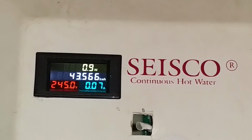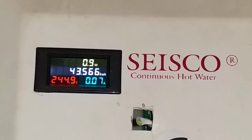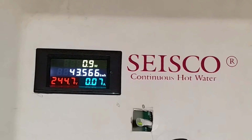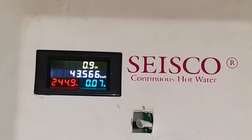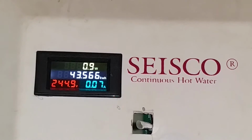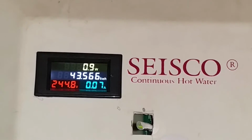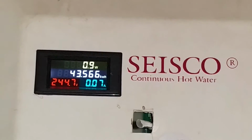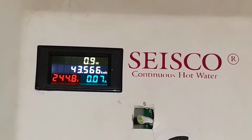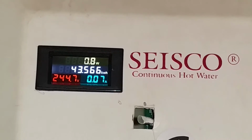Most water heaters of this size, or really a whole house of any size, are going to have two sets of wires going to them, the current split up. This is 80 amps total current, so there's two 8 gauge wires, if I recall, 40 amps each. So you just stick with one phase. You have two wires from the same phase going through the center of that toroid coil, and then it will cumulatively add up the total current.